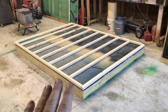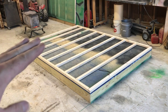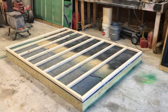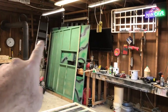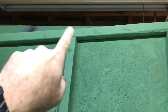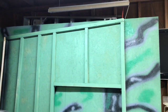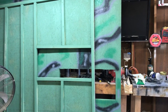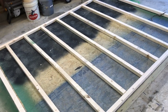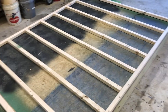I made the roof the size of the actual frame, which should match the tops of every wall, and the roof is going to have the pitch. I'm going to lay it straight down on top of all the top boards and take some decking screws through it to pull it down and grab the roof. If there are any gaps, I'll use spray foam to fill them in. Now I'm going to lay my plywood down, see what I have to cut, and get it mounted on there.